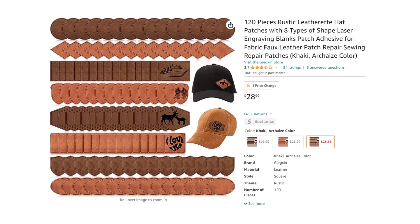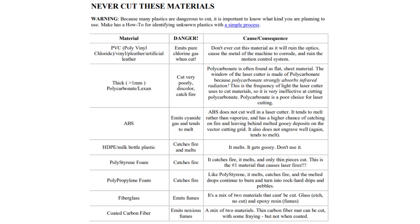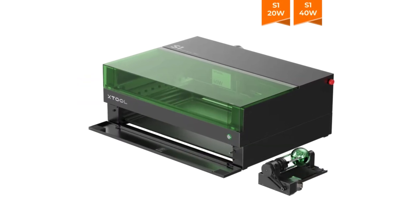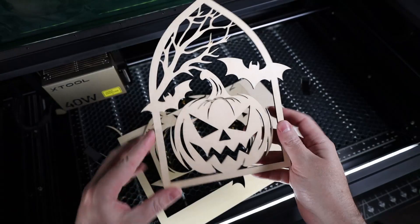You can also cut and engrave leather, but make sure it's actually real leather and not PVC leather — because when you cut it, it makes chlorine gas, which is extremely toxic and can also damage electronics. I highly suggest pausing and screenshotting the list of harmful materials so you can make sure you're not cutting any of them. I'll also have a link to this in the description below, along with links to everything I showed in this video. If you're watching this the day it came out, the S1 is now available for purchase, and you have a few different options: just the machine itself, the Rotary and Riser bundle, or the all-in-one setup. If you're ordering within the first month, they're going to be giving you the Air Assist and Honeycomb setup as a free gift, so it's really going to depend on what you're doing and what you need.